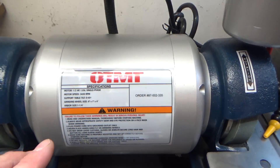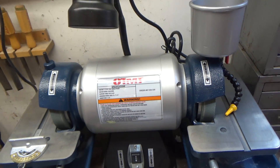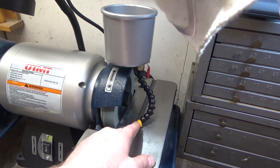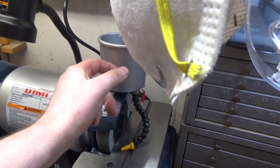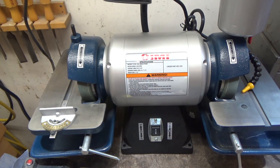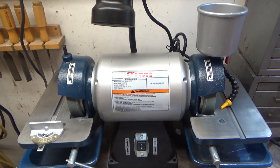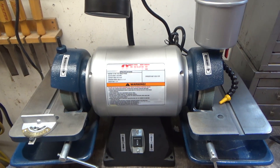This tool is designed to run at 3,450 RPM, which is pretty fast — it pulls off material really quickly. I thought it might be nice to slow it down, but it's a single speed device. They did provide a water drip feed for cooling, with a valve and a small reservoir. But I'm really hesitant to get water anywhere near my tools, especially cast iron — rust drives me crazy. So I've been holding off on that and thought maybe slowing it down would help, and I found a solution.